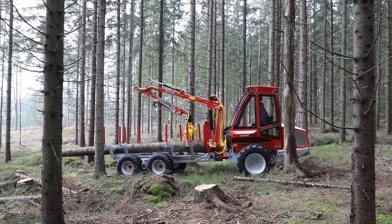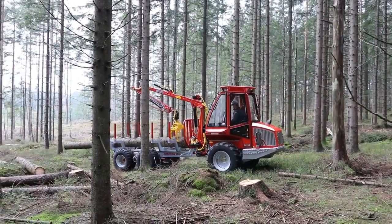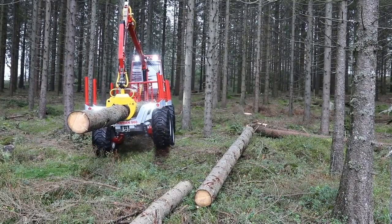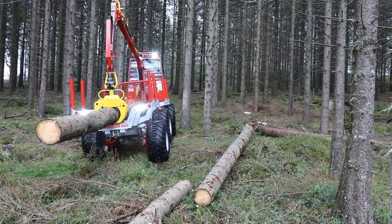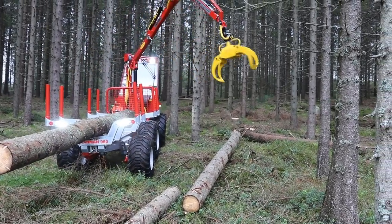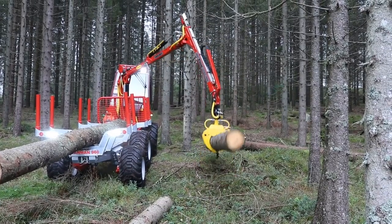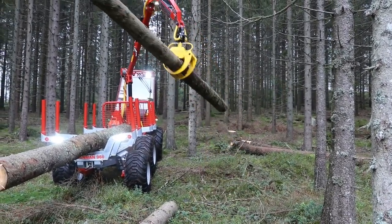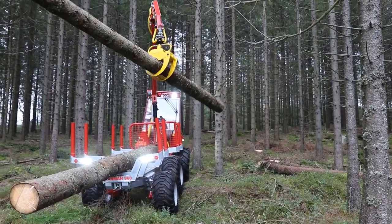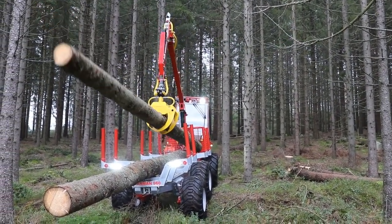The machine has 6-wheel drive on high and low gears. In the transport gear it is front-wheel drive. The rear is Kranman's well-proven FlexiDrive X drive system with bubble drive motors. Some benefits of this are a very reliable and proven system, easy to maintain. It is possible to mount bogie bands and to be able to transport the forwarder on a dolly behind the car. With the spacious cabin and the arched window, you get a very good all-round view.